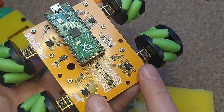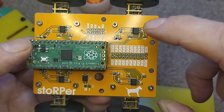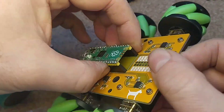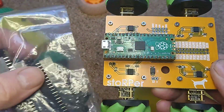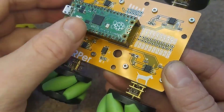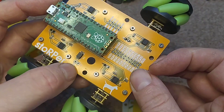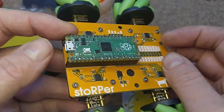The premise is to be pretty affordable for people to get into robotics, but also pretty adaptable. The basic package is the PCB, which has four L9110S motor drivers already on board. I supply it with the header socket for you to populate into the board to put your Pico in — or you could solder it direct for a more flush fit. The chassis has an external power input so you can drive it from a battery solution or straight from USB.